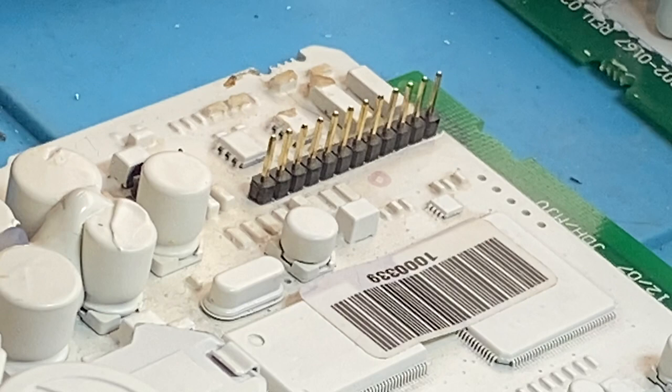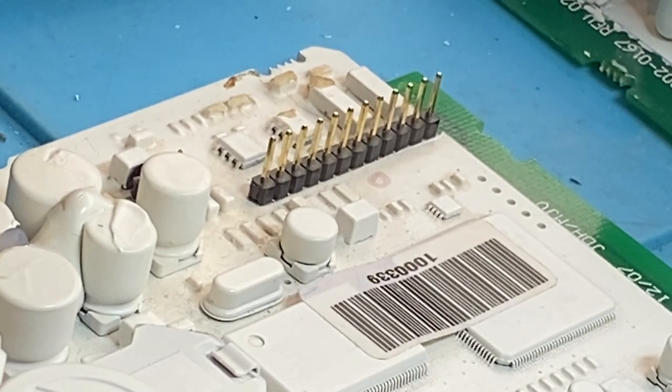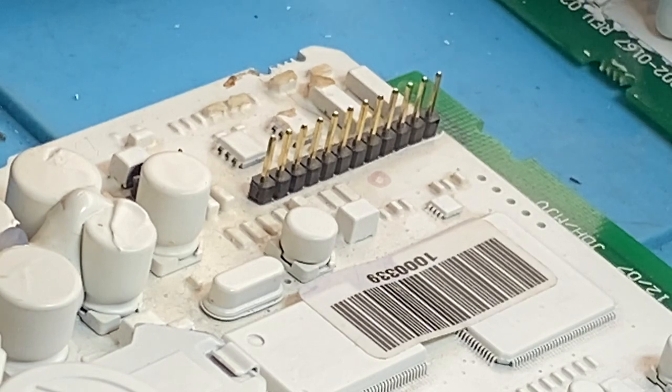So you want to run enough gain on the front of these detectors to lift the signal out of the noise, but not amplify the ground noise component so much, because you're going to run out of headroom. The input signal is going to come up hard against the plus and minus 5 volt rails, and well, actually it won't on these, because it's got